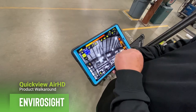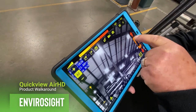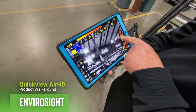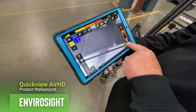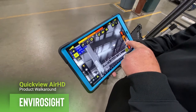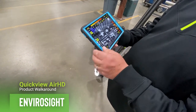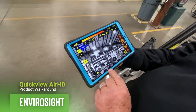The camera itself is controlled by the arrows on the bottom right. If you hit the top arrow, it will move the motor up and down for centering. To zoom, hit the black arrow and go up — you can watch it zoom in. That's only at 11 power, so you can imagine how far it can go. Light intensity is set here — slide the marker up or just hit full power and the camera light will come on. You can adjust it at any point. Some customers use this for manhole inspection, so you want to be able to pull the light down so it doesn't reflect back and hurt your image.